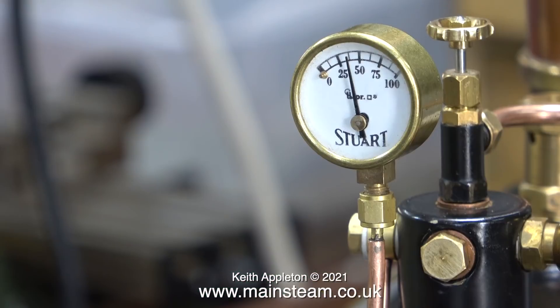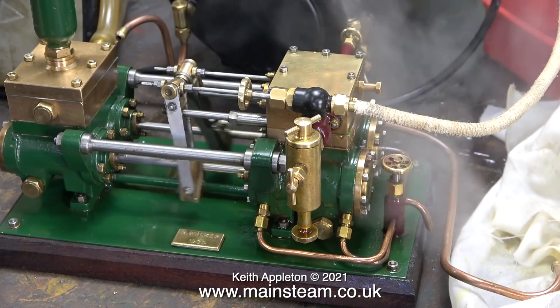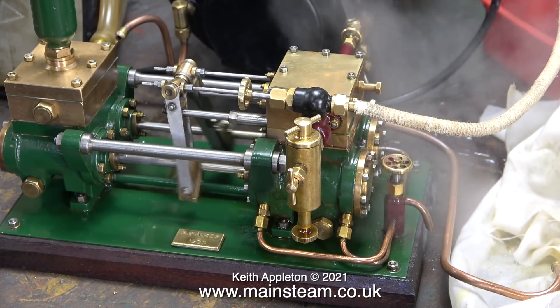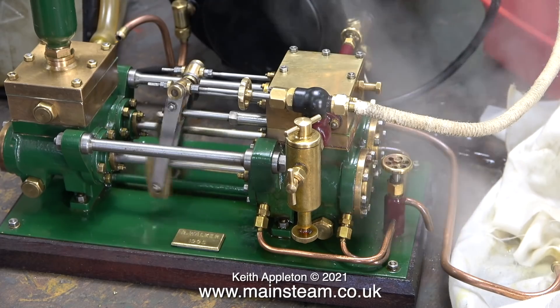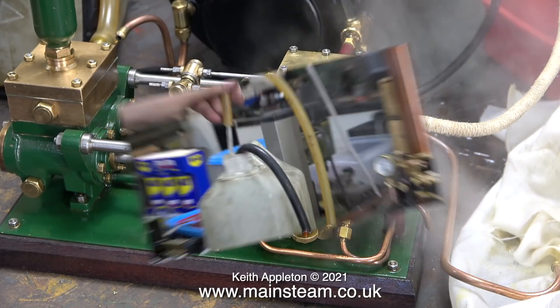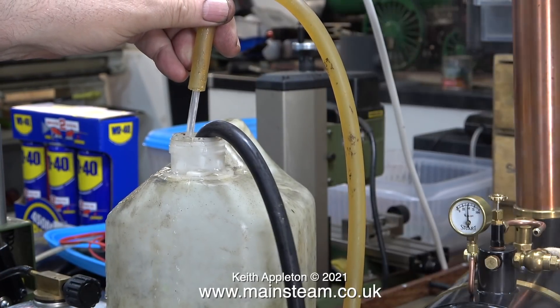The pressure is rising. The burner is still emitting carbon monoxide, so I've removed the batteries from the detector and opened all the doors — and I will mention a health and safety notice: do not remove the batteries from your carbon monoxide detector, remove the source of the carbon monoxide. I'll be working on that in a couple of future episodes.